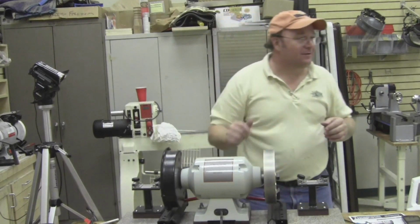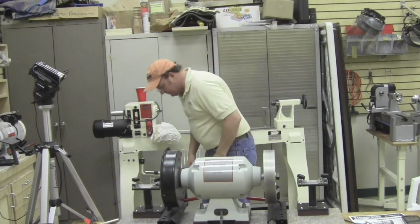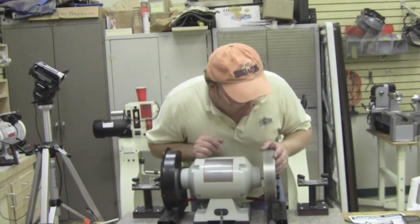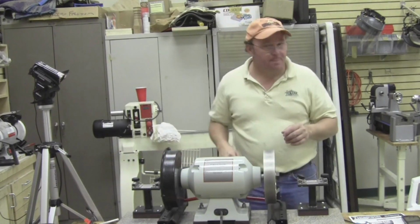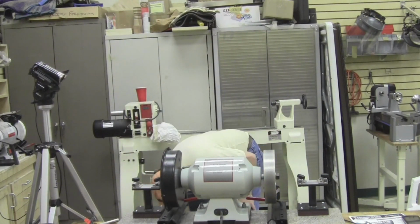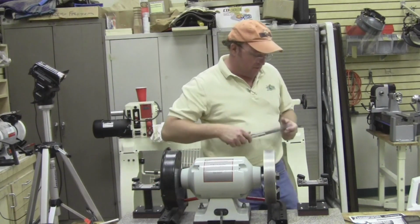So there's a lot of difference there when you look at how you're going to use it. That's the true drawback to making one with a smaller angle than 60 degrees, not having the heel ground off. The point is, you can't make that sweep right at the bottom of the bowl, because you end up standing on the point with nothing to support it.